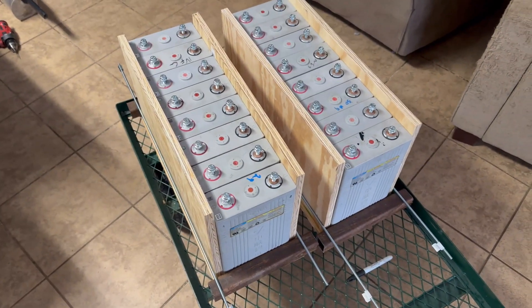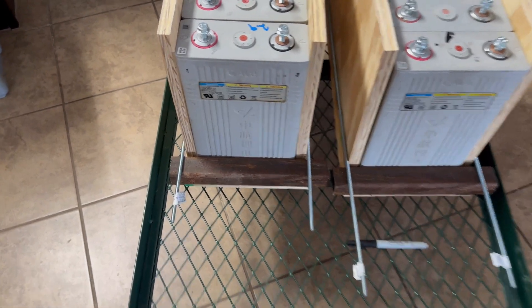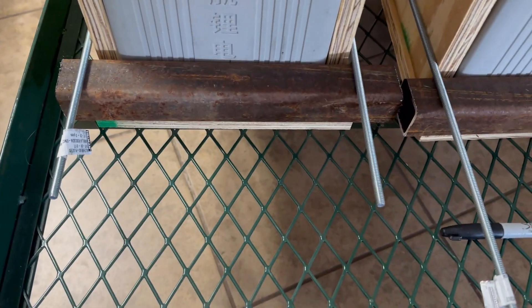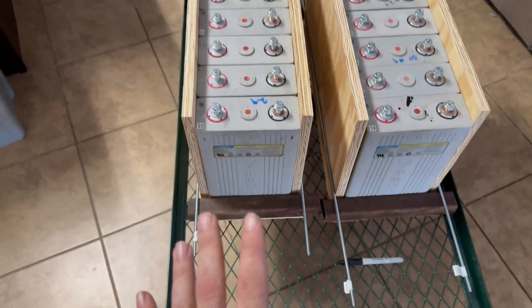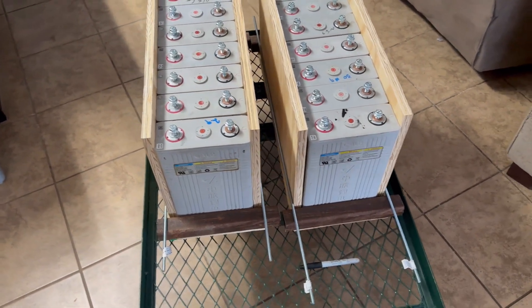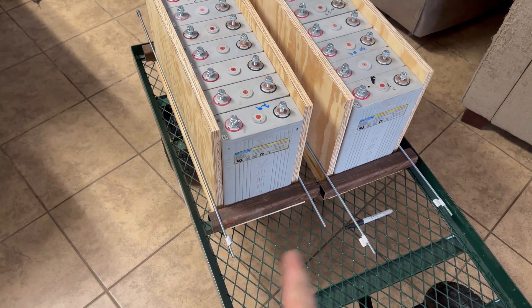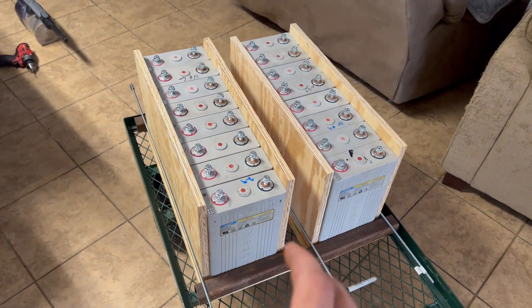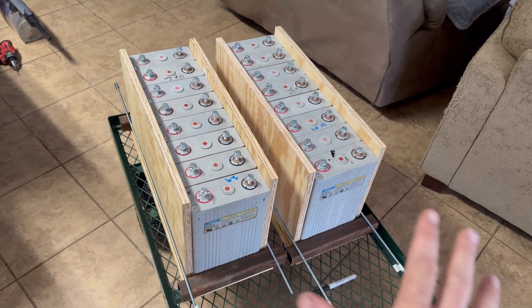Cell holders are pretty much done — the boxes, at least the sides. Now I'm marking basically where I put in some square tubing, and I'm going to mark where the all-thread goes to put holes. Between the steel bar and the battery is going to be a piece of wood, and the square tubing will help put even pressure on it, so I'm not going to tighten the heck out of these. I've got to drill the holes in these, clean them up, sand them down to get all the sharp edges off, and then those will be ready to go. I don't think I'm going to paint this just yet.